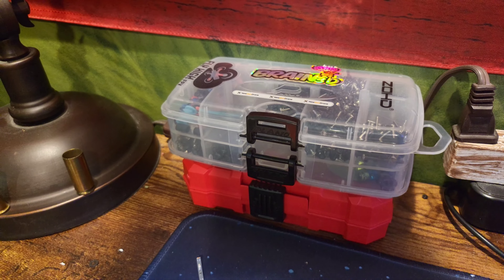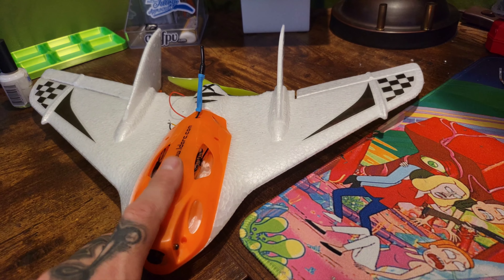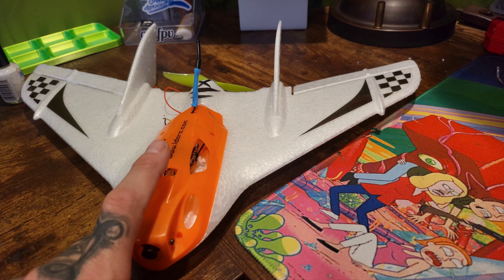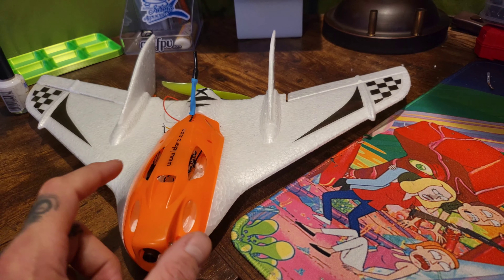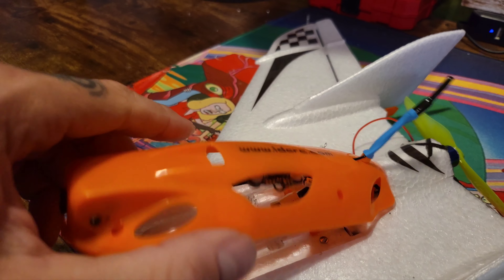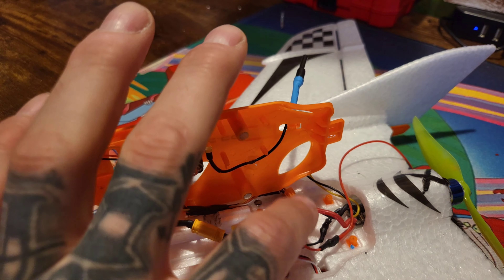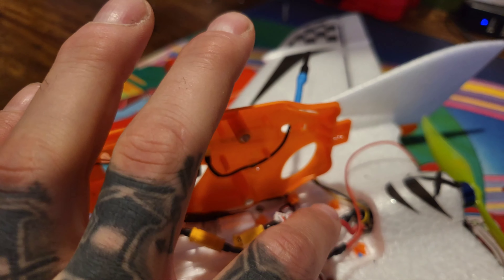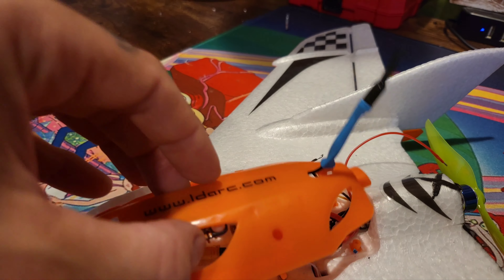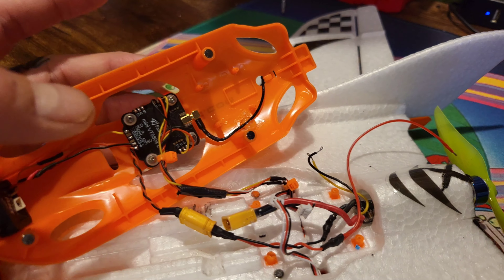That was the most satisfying right there. The receiver should be here today. I've got to put some servo plugs on the servos because it doesn't come with them. The magnets on this thing are incredible — there's a lot in here already. I soldered some Y-adapters to the ESC. The ESC doesn't have a BEC, so the power coming from it is whatever the battery is providing, and that's why we went with the receiver that could handle the power — the Panda RC VTX.